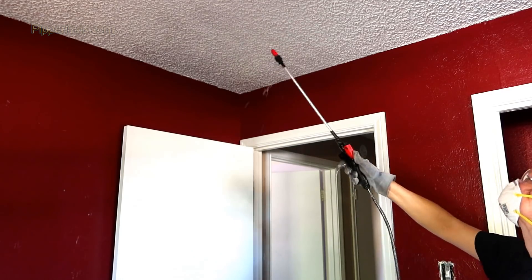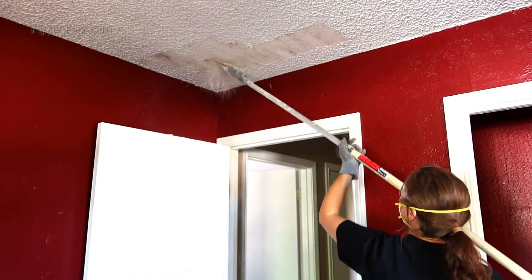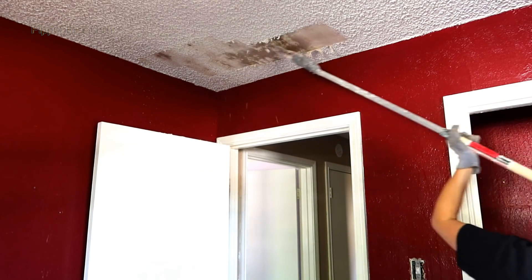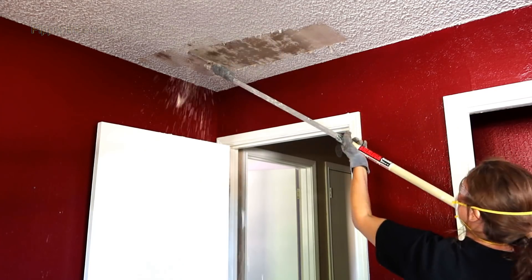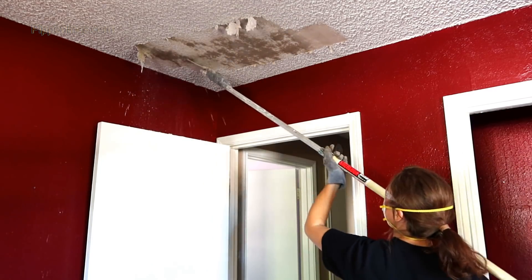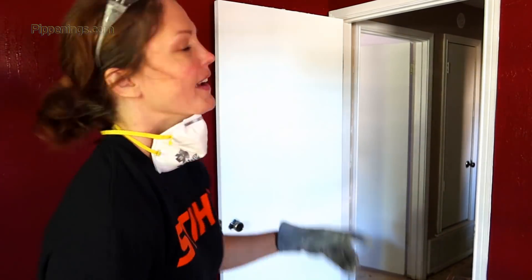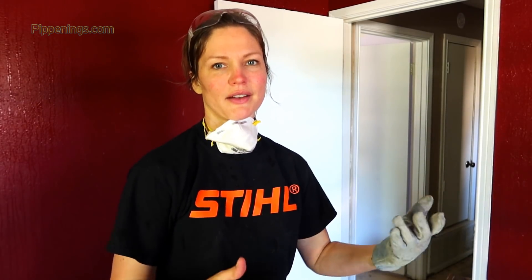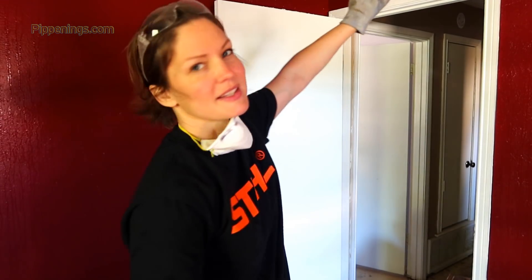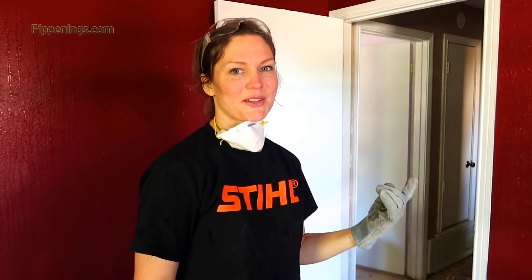Around the vent it's a little different color, so that's why it's coming off harder. I basically have to scrape it, then moisten the old stuff underneath. Once I got the first layer scraped off, I saturated it with water again and then it came off easier. Hopefully this is the only room that's been painted — the master bedroom has not, so that's all done.